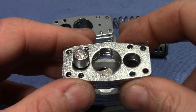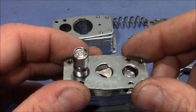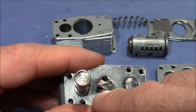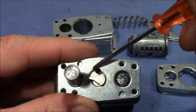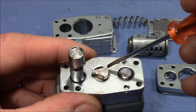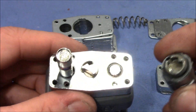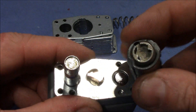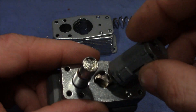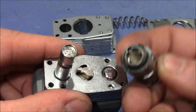The remaining layers are all the same. Next comes a special layer that restricts the turning motion of the cam — there is a round cutout, so the actuator can only turn a certain amount before it stops. The shape of the end of the actuator fits the shape of the end of the plug, so by turning the plug you turn the actuator.